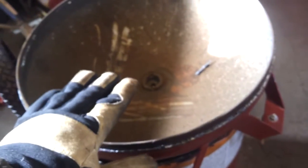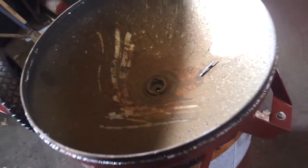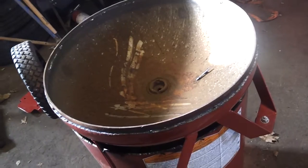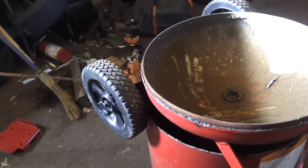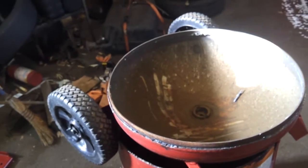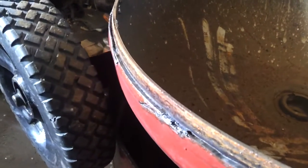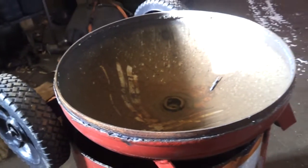Put the plate down and then weld this flange to the plate, because this will be filled with vermiculite. Weld the plate to the bottom after it's filled with vermiculite, then weld this flange back on top of that plate. I think that's what I might do. That actually will come in real handy. So anyways, an accidental discovery. That might be helpful for you guys when you build yours.